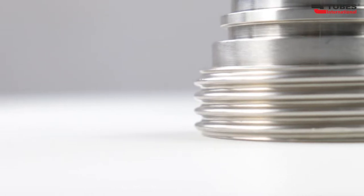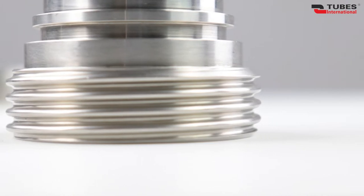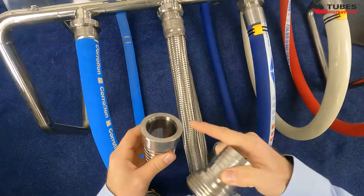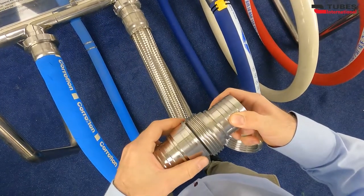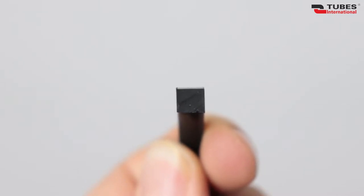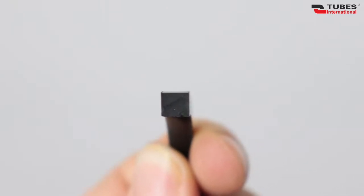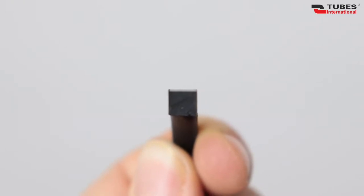The couplings are designed for pipes according to ISO 2037 standard. They have a flat sealing face, so pipeline sections can be easily dismantled for cleaning. A standard seal has a square cross section and comes in PTFE, Viton, EPDM or NBR rubber. The couplings are made of 316 stainless steel.